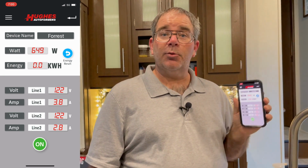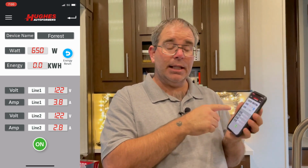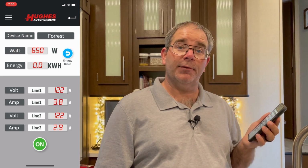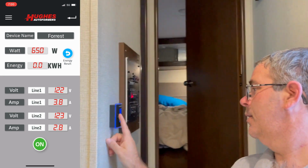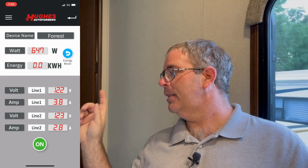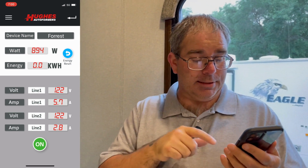So what I'm curious to see is we're going to kick the AC on real quick, and we're going to see if we can see live what happens to the amperage and what leg my main AC runs off of. So let's see how much amperage the AC draws. So we're going to come right over here, and we're going to kick the AC down about 72 degrees. That should make it kick on. And you can watch the meter over here on the right. So it kicked on. Let's see how long it takes to show on the app.